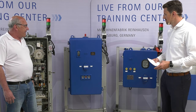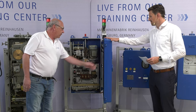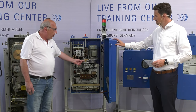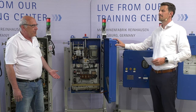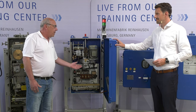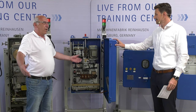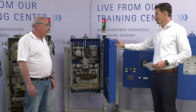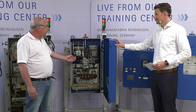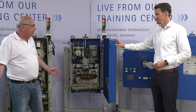Also here on the MA7, we have a transmission gear inside. This is an old one, which is filled with oil. Also here we can have a leakage. And the problem is always, when you go somewhere and maybe replace the O-rings from the hand crank, it's about the warranty. Half a year later, you can get the leakage somewhere else. And it's also not touch proof.